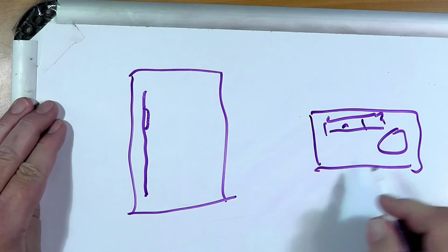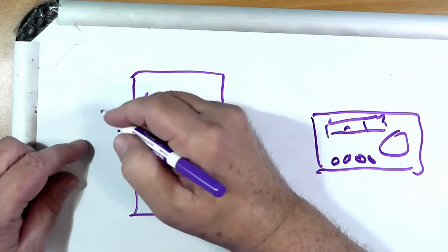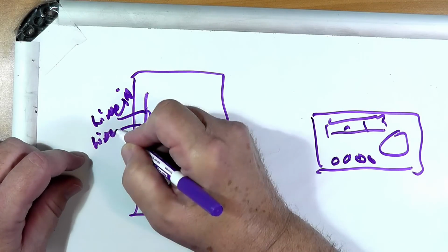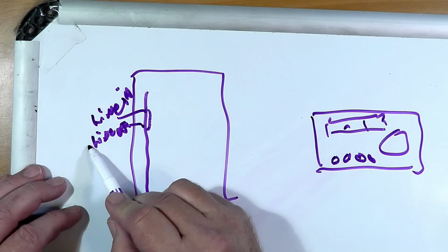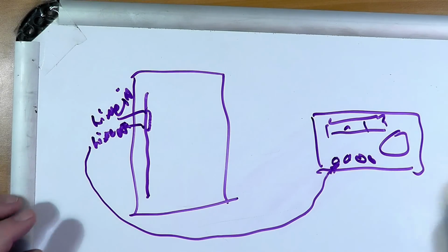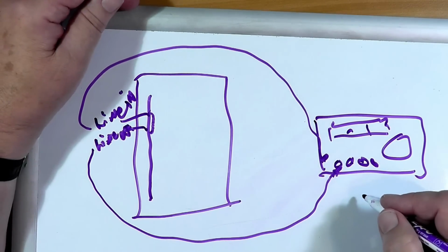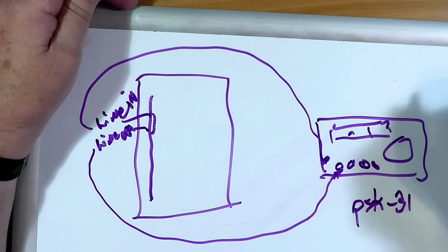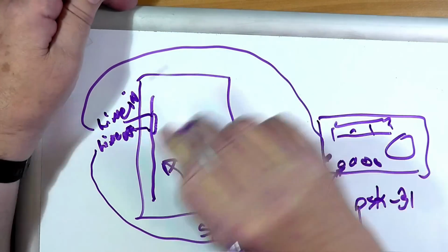they would just take the output of the sound card. There's often on a sound card something called line in and line out, or sometimes just speaker and microphone. But you would hook the output with a cable directly to the radio's input in the microphone jack. And then you'd take the earphone jack or the speaker jack and connect that around to the line in. And that would work really well. And we could work some of the early digital modes that were available, the first of which that really caught on was PSK31. And you'd put amateur radio software in your computer,